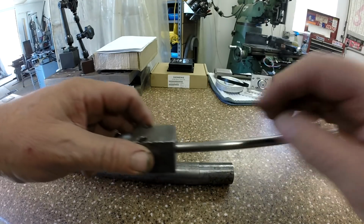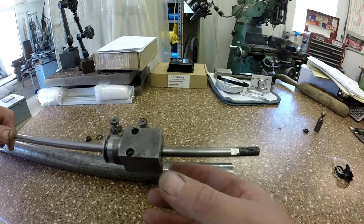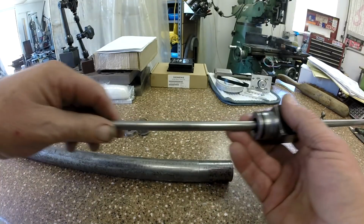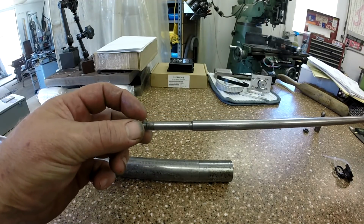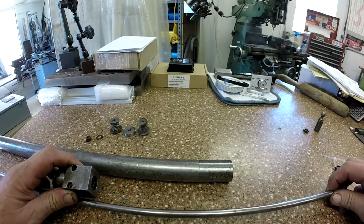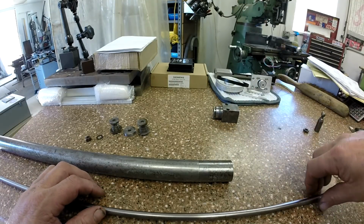And then when I did get it loose, this goes in through the seal and everything, and I started pulling it out. After I removed, there's a piece that goes right here. There's a little ball connector for a swivel where it connects to the machine, and then I started pulling out this way. Then I felt those threads right there on that seal, and I go, you know what, I don't really want to force it that way. I got down here to the piston end, and you can see we've got a smaller diameter, and I was able to take all those parts off, and then this just comes slipping right off of there, and you don't have to pull that seal past the threads. So that's pretty important. You don't want to damage your rod seal, your dust seal, or even worse, your rod guide. You got a bronze rod guide in there, so you don't want to damage any of that.